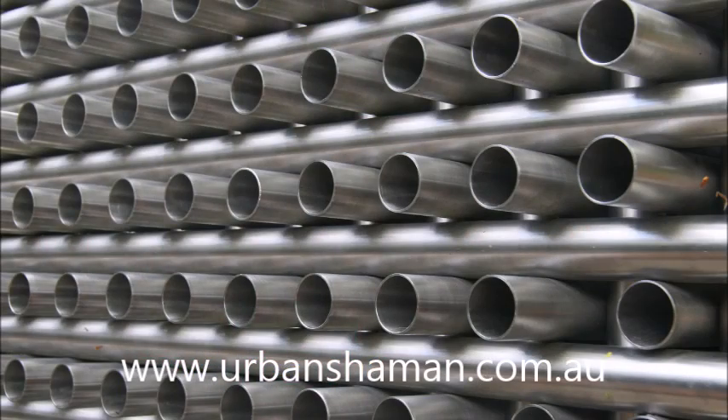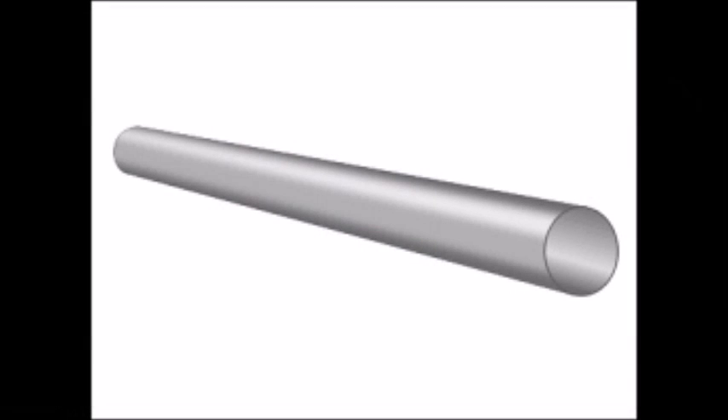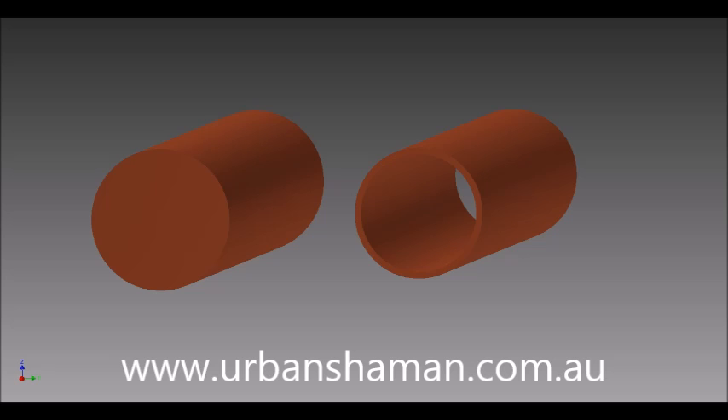As for the shape of the material, a cylinder in the form of a tube or rod seems to be the most practical, though a square, triangular or rectangular cross section is possible. So let's assume we decide upon a tube or a rod. A tube is hollow while a rod is solid. Weight and cost become the primary issue. From a cost-weight strength analysis, tube wins hands down — the weight and cost are considerably reduced, while the loss of any inherent strength is minimal in comparison.